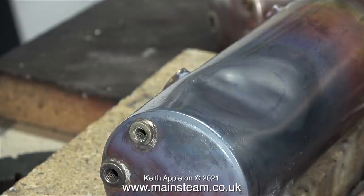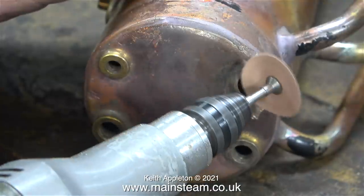After quite a while — because this video is heavily edited — the area did turn red, so I removed the heat and let it cool. Normally when annealing you quench the part in water to rapidly cool it, but that's not a good idea with a model boiler. I had to let the boiler cool slowly in its own time.